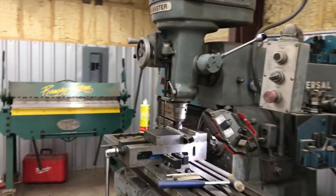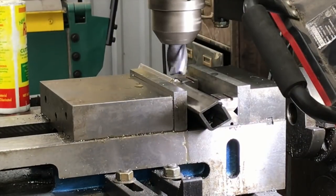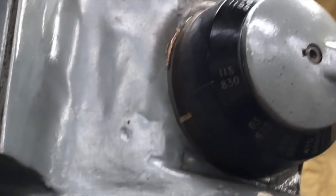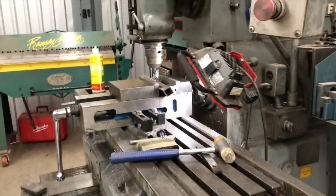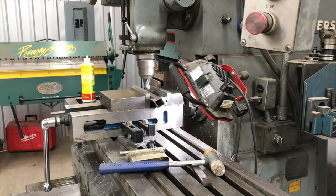Let me get you in closer where you can see. We've got this thing down to about 100 RPMs — there's 85 and 115, so we're just a little under 115. We'll know immediately if this thing is going to chatter or be not very rigid. With stainless you want to go slow but maintain pretty good feed pressure — pretty firm.